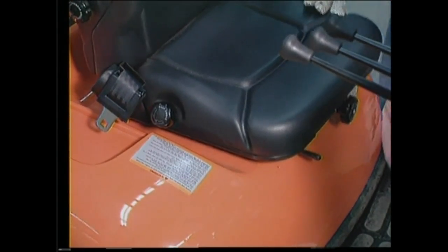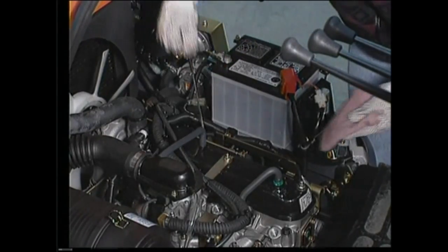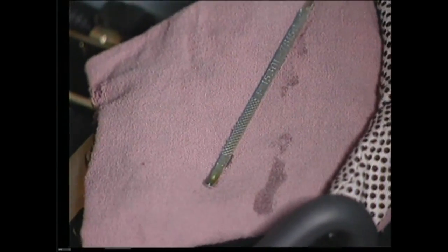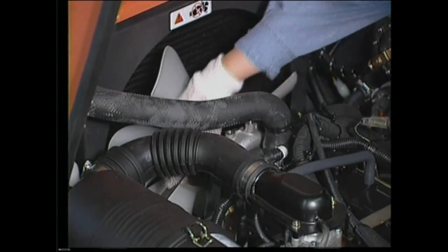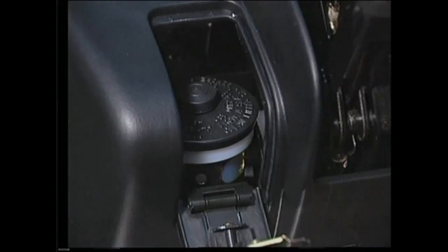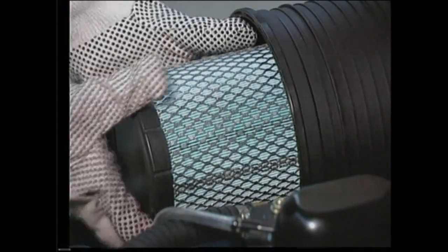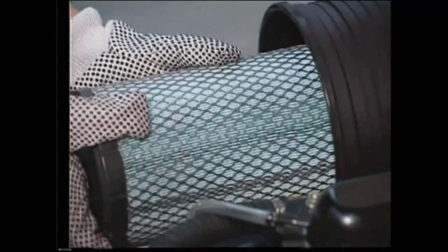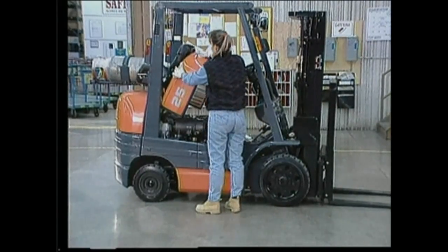Check the cylinder tie-down latches to make sure the propane cylinder is secure. Open up the engine cover and inspect the engine compartment and fluid levels. Check the battery, the engine oil, transmission fluid, the fan belts and hoses — it's important that they are not frayed or worn. Check the brake fluid reservoir, hydraulic oil level, the radiator coolant, and finally inspect the air filter. A dirty filter can increase harmful or poisonous exhaust gases. Close the engine cover and secure the propane cylinder.